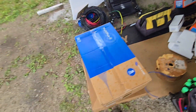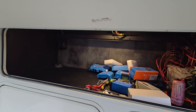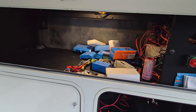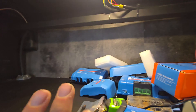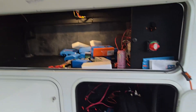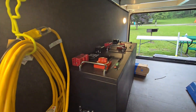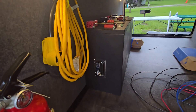We're putting in some big inverters - some 5000VA Multi-Plus Twos. We're going to have to hang them on an angle here, kind of like that one Paradigm I did where I put them in the back where they had that garage space. About 2500-ish watts on the roof. Three solar controllers because we're going to keep the factory panel that he's got. We've got three Big Beard batteries hanging out in here. Only got two right now, but there'll be a third one - I'm just waiting for it to get delivered, which will hopefully be today or tomorrow.